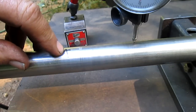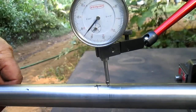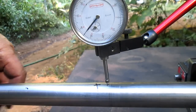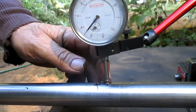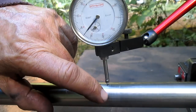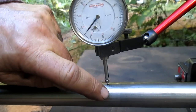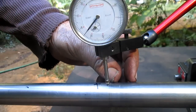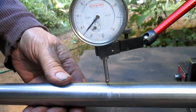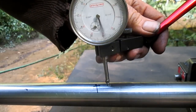So we're going to do a heat treatment on it and see if we can get this thing to drop down. And that's right there, about 2, and that's where it got bent. This is the point that it took. I'm seeing a line here, so I'm guessing the cutlass bearing is right here. Oh no, this is not the propeller side. So there was a bearing right here somewhere that this rode on. So we're going to move our indicator, and we're going to heat that spot.